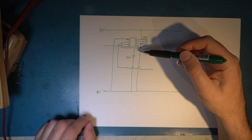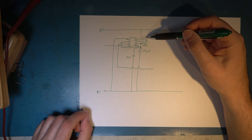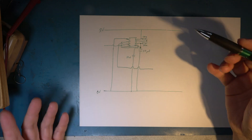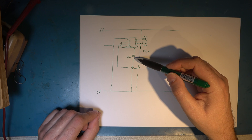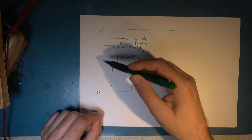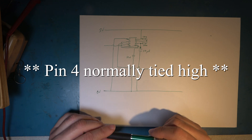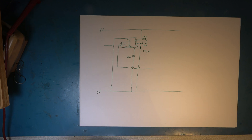We have a basic astable circuit for the 555. The resistors are set so that it's more or less a 50-50 duty cycle, and a 10 nanofarad capacitor gives about the right frequency. There's 10 nF decoupling on pin 5, not desperately important. What I want to point out is pin 4 — this is reset, and it's normally held high to allow it to cycle. I wanted to be able to disable this oscillator without switching the power off to the whole thing, and I'll come to why in a moment.